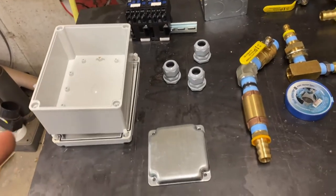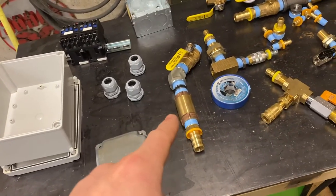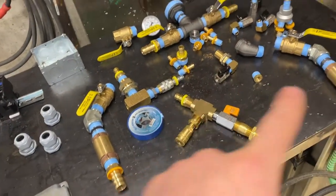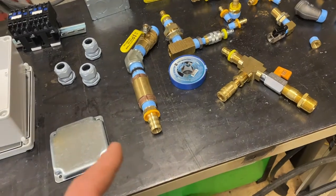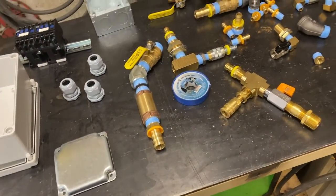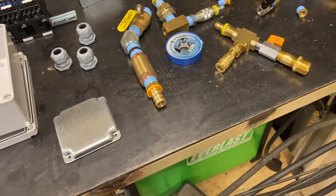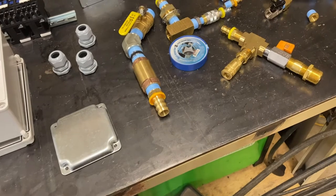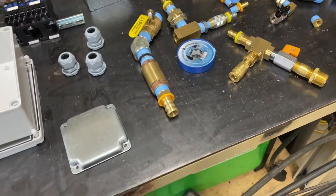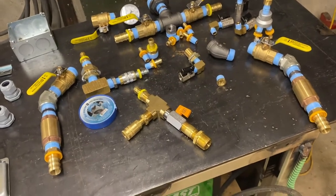And the pressure switch, I'm gonna drive off of the middle tank. Each compressor will have a check valve coming off of it. I don't really think it's necessary. I did a little bit of research and there wasn't anything real solid out there for answers. I'm gonna run it anyways. It's not gonna hurt anything, but it could help. And then everything's gonna be ball valve, so that I can isolate stuff if I need to, and don't have to drain the entire system in order to work on it.